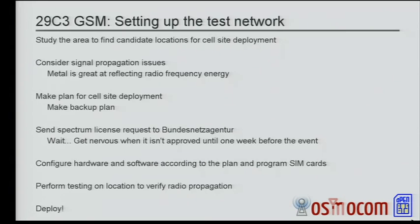The process for setting up this test network: we need to look at the area we want to provide coverage to, see how many base stations we need, where we can put them, where there is good connectivity, and where there is power. We need to consider signal propagation — whether it's inside a building or outdoors, are there trees or large buildings in the way? Any kind of metal surface is really good at causing problems for radio communication. Reinforced concrete will also shield radio signals very effectively.